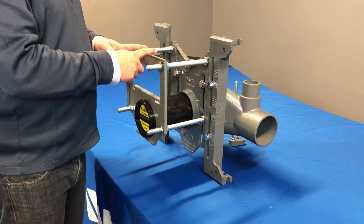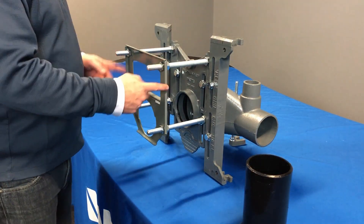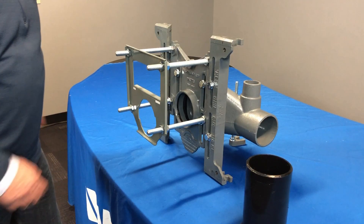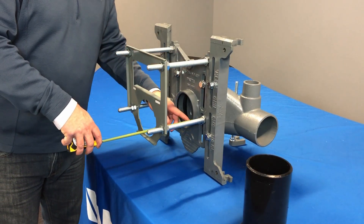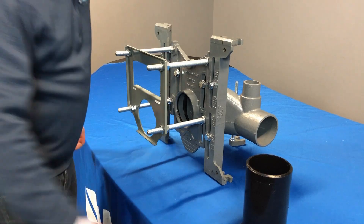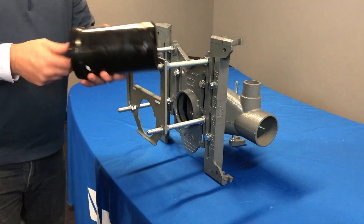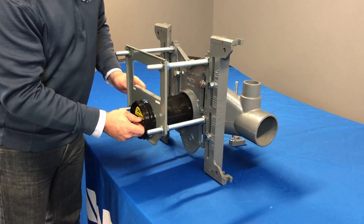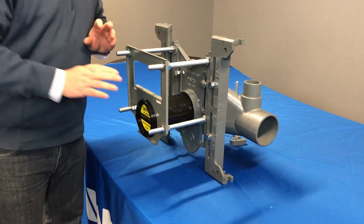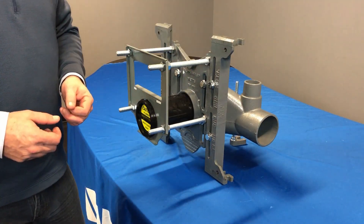Watts has now changed this over to an epoxy coated steel, and it's going to serve many purposes. When installing this, the first thing you want to do is adjust this wall plate out to your finished wall. Once it's out to your finished wall, take a quick measurement from the back side of the face plate to the back of the carrier body itself. Transfer that measurement over to the nipple, cut it off, and add some lubricant — this is going to be provided by Watts. Once you get that on, slide that nipple through our wall plate and quarter turn. Your nipple is now set; it's sealed and, with the O-ring gasket, it's actually going to give you up to a 30-pound test.